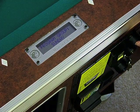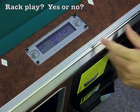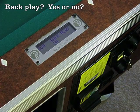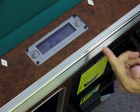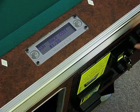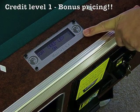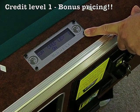Go to start to get into it. It's a very yes/no type situation. Do you want rack play? Use the start button to toggle on or off. Anytime you select off, it jumps to the next program level. We'll go ahead and set rack play on. Do you want to charge $2 a game — more or less? Use the speed pull button to go down in price, or the start button to go up. The next item is credit level one: when customers put in a set amount you define, they get a bonus amount of racks.